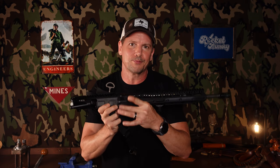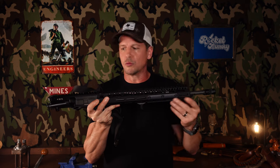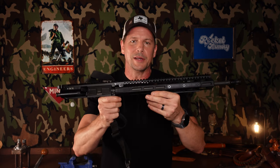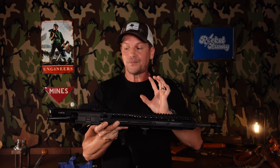When it comes to uppers, I have seen a lot of new AR owners who put together their own upper have problems, and where it's really going to come into play is your barrel nut. You didn't torque it down properly, and then you're out at the range and it starts coming undone on you. There's something to be said for just buying an assembled upper. Something like Bravo Company — just get it, and it's going to work for you. The gas port, tube, everything — it's all going to be dialed in and just work.